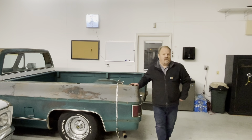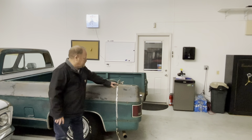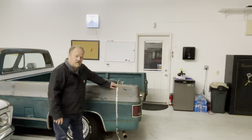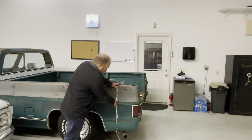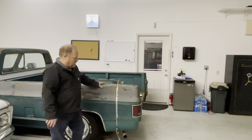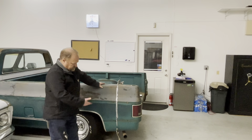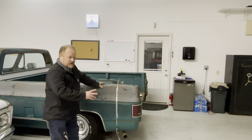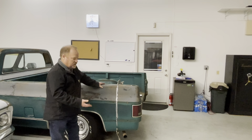I don't think we're too far off from starting our welding. I'll start up here and do my spot welds — probably start right at this corner that's real defining and bring it down. That may push in just a little bit to get it lined up perfectly, then I'll tack it as we go all the way down to the bottom side. Overall it's come along very well. I find the contour on the bottom is just a little bit different because we removed 6 inches, but I think it'll pull in just right — I don't think I'm going to need any slices or anything like that.